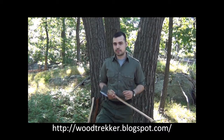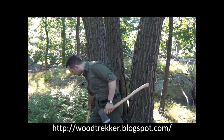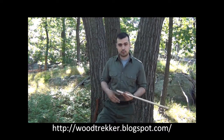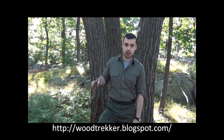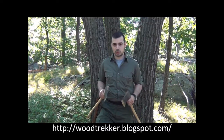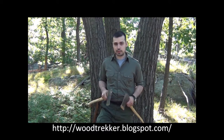The theory goes that this will prevent sticking in the wood because it limits the amount of contact between the wood you're chopping and the metal on the axe. If we look at modern axe designs, again almost uniformly — there are some exceptions — we see flat cheeks; the cheeks are the same thickness in the center as they are on either end. There's a lot of speculation as to which design is better and why the change occurred, and people are very opinionated on the issue. However, I haven't seen any data whatsoever, I haven't seen any type of comparison testing being done.